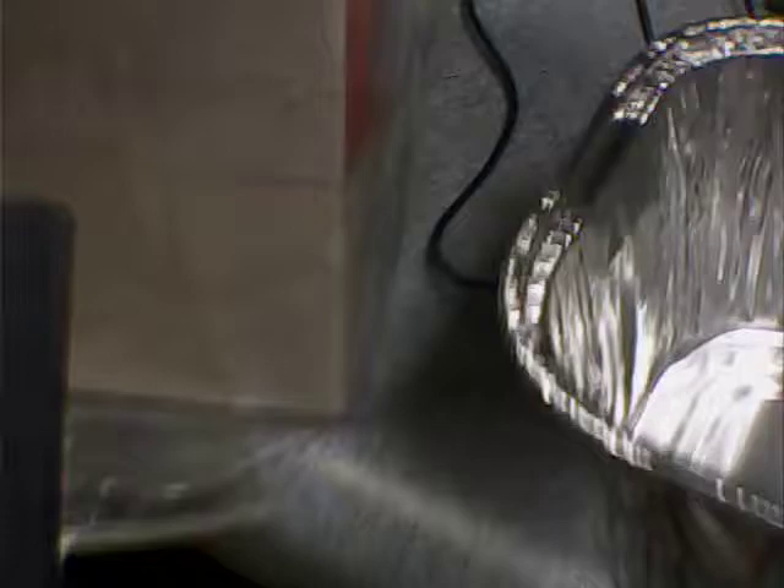Dip it in your electrolyte — I use choline chloride and levulinic acid, so it's a biochemical deep eutectic, and it works very nicely. Then I simply wrap the encased graphite electrode — no manganese dioxide, no activated carbon, no mass — put it in the dialysis tube, and don't let the aluminum contact it.